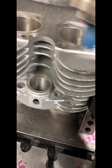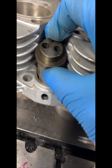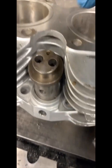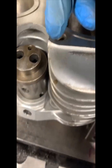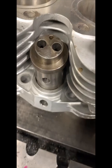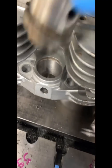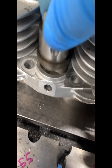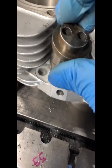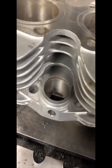I talked about removing material up here to make sure the push rod tubes lay down — that's still valid. I just want to focus on where it's going to foul, and it looks like it's definitely going to foul right here. The only concern about up here is as you start opening this up, you're getting very close to the stud holes where the threads are, so I want to focus strictly on that area. Down low there's more clearance. So it's almost like somewhere here and down low we should open up, and once we can open that up enough to get a tool in place to drive it in, then we can put a push rod tube and see if it will lay over.